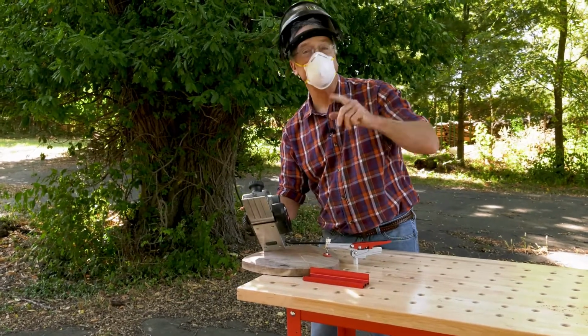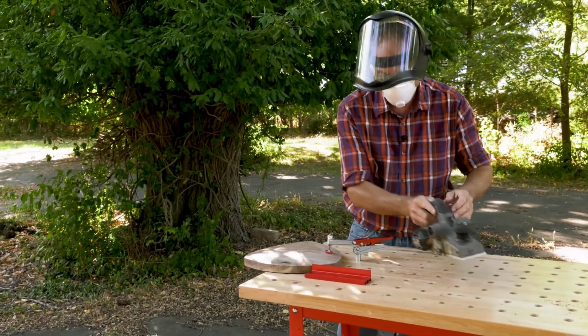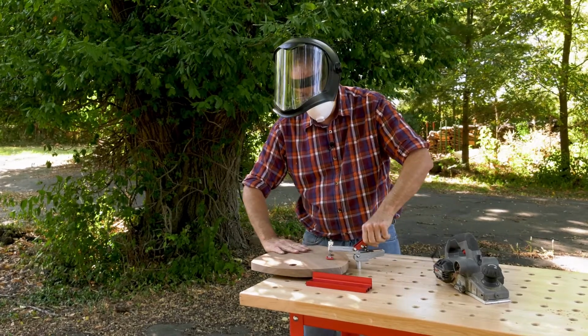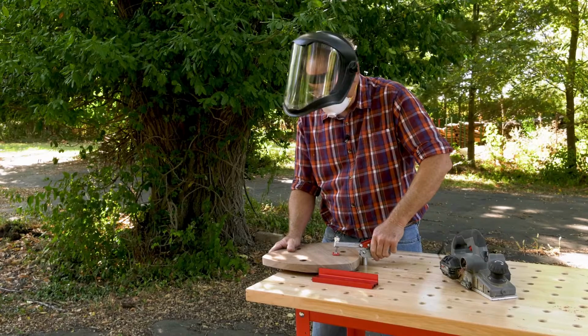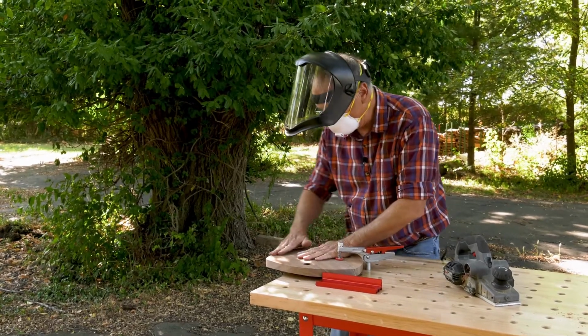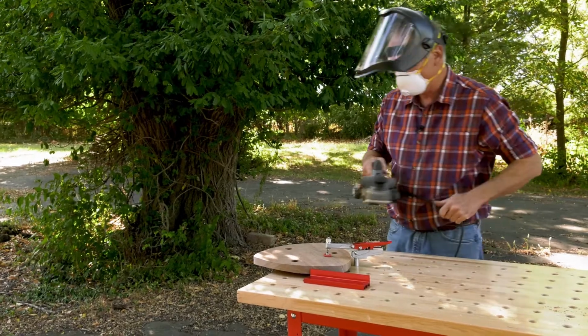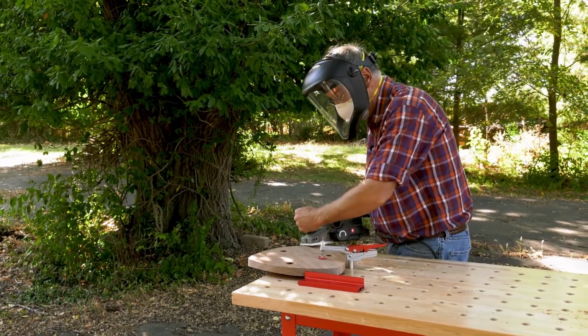Now, you want to use a light touch on this tool, and I have it set to take off 3/64 of an inch at a time. And on the bottom, with the holes up now, secure that, and I just need to relieve that ever so slightly to make this edge thinner. Once I get that done, a bit of sanding, and then we can assemble the parts.